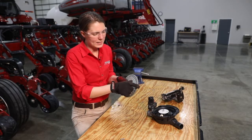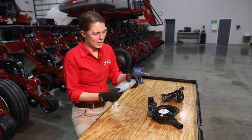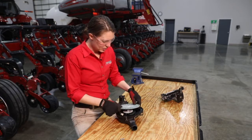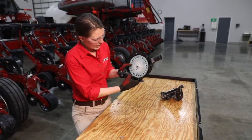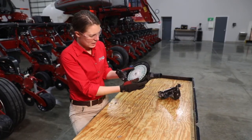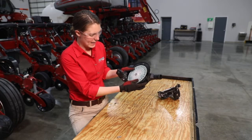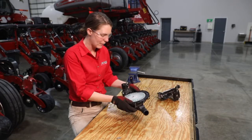Other things to look at are the drive teeth along the outside of the disc. We want to check to make sure there's no excessive wear in those drive teeth. Another good check is that when you install that seed disc, line it up with the V drive teeth as well, and make sure there's plenty of contact between the drive teeth of the disc and of the V drive motor.